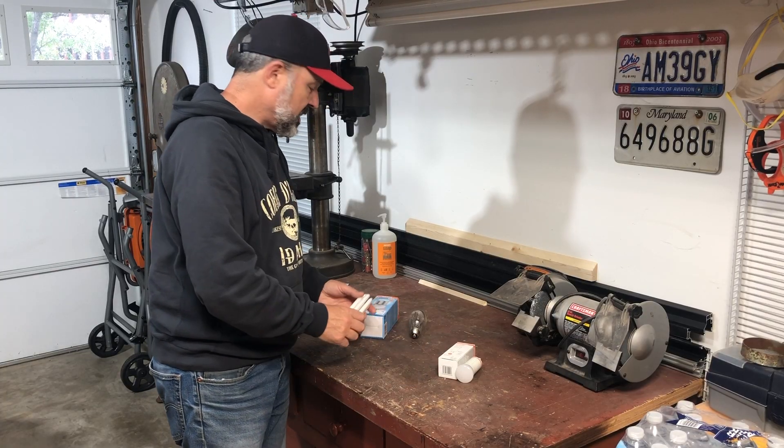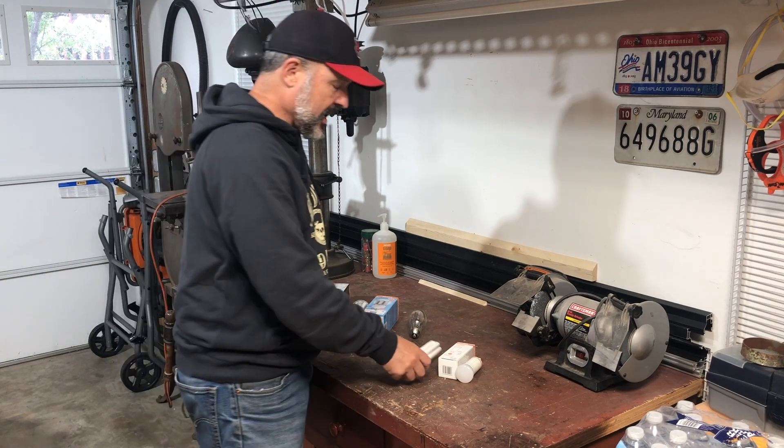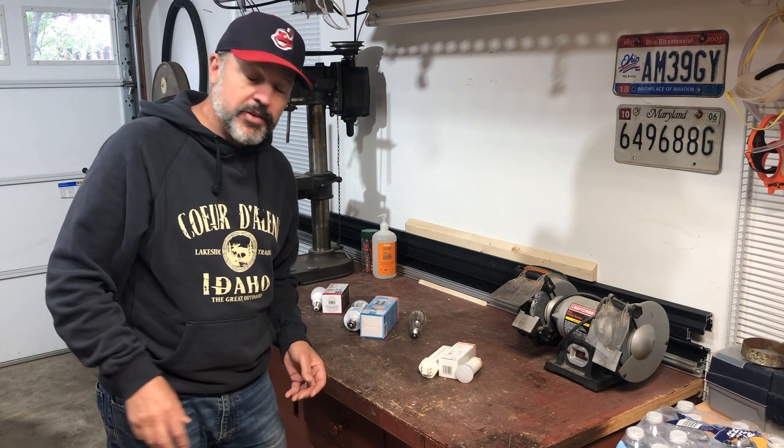You have to be careful — you want to know the voltage of the fixtures that you're messing with, so you need to test them. You need to know the voltage. If you go trying to put a lamp that is only rated for 120 volts and you're actually dealing with 277, it's not going to work and you'll probably just burn up the lamp. So don't waste your money — check your voltage. I'm going to save my church a ton of money by doing LED conversions on a number of our exterior fixtures.